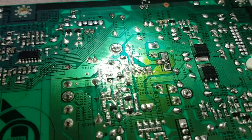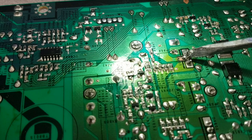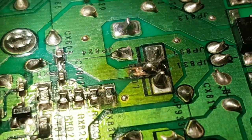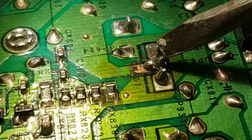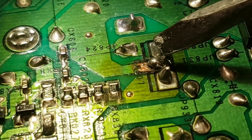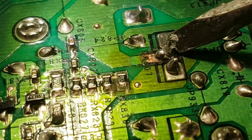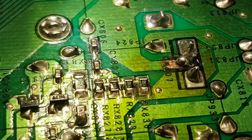So how is that similar to a TV repair shop? Looking at this board reminded me. A board was sent in for repair and it had been previously repaired, probably a couple of years ago. There was a solder joint here — this is a known issue with these boards. You can see how the leg is detached. This is a very well-known issue on many boards, including Samsung boards. People basically just solder the leg, but sometimes the solder corrodes and fails after a couple years of use.